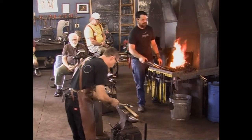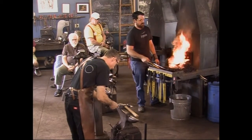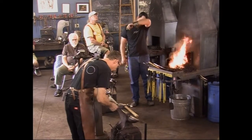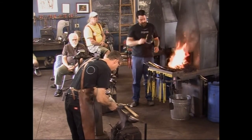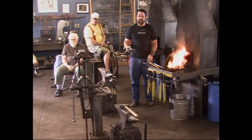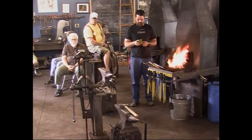We'll be butchering it very soon and reducing, so I'm going to set my calipers for actually just a little more than 1 inch, maybe 1 1/8 inch, something like that, so I can end shy of my target and forge down afterwards.